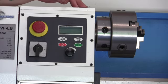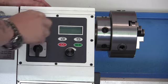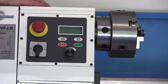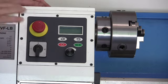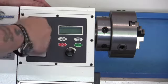We'll have the emergency stop. You get the machine, flip the breaker, the little blue handle up, make sure you see the red. Plug the machine into the wall. Come up here forward, trip or reset your emergency stop to where it is off. Okay? Because if you don't, when you try to put the power on, it won't do anything.